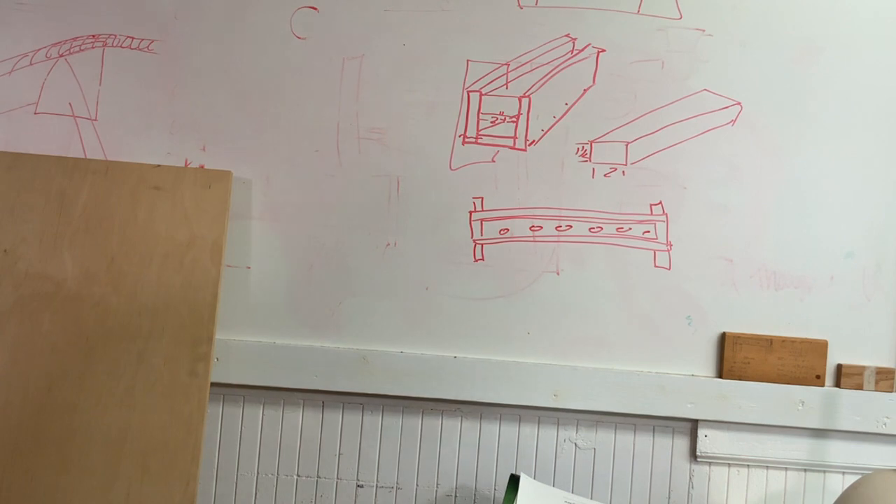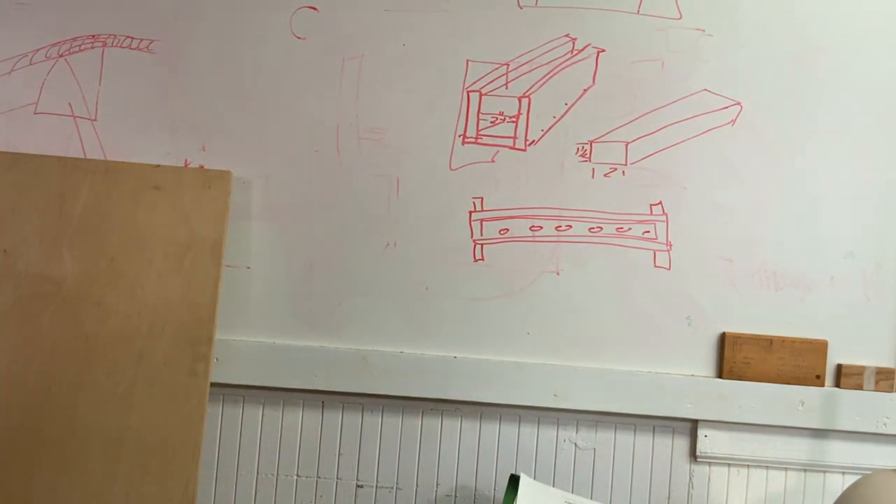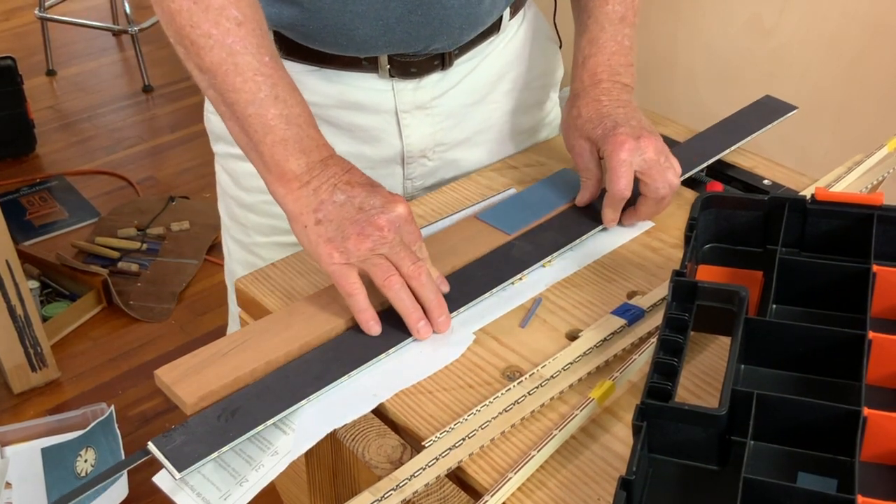How do you go from there to the finished strip? Table saw, on a sled. You can do it on a bandsaw, but the bandsaw leaves a fuzz and the table saw looks better. I use a real thin blade and a stop. You absolutely sand it — knock that burr off, get the fuzz off, and put them together. You don't absolutely need to glue in between each one of these because the black-white cover veneer you put on top glues them all together.